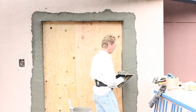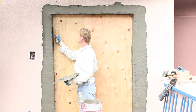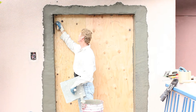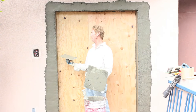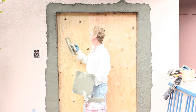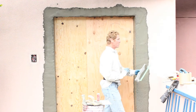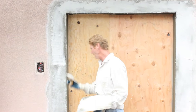Finishing up the second coat. These inside pieces, we're just leaving an eighth of an inch — building out an eighth of an inch where I need a little bit of relief. This actually takes a lot of practice. I wouldn't expect anybody without about eight years of experience to try this, because these corners have to line up here to here — they're off by a quarter inch instead of seven-eighths, they're almost an inch and a half. Everything has got to be true, plumb, and level. Now everything is true and plumb. I'm allowing this to set; with all the accelerators in it, I figure about 20 minutes and then I'm going to hard rubber float it, then sponge float it.